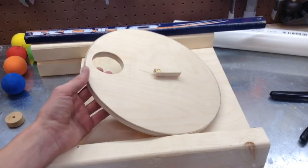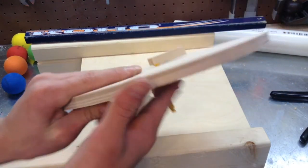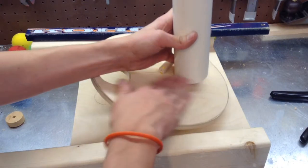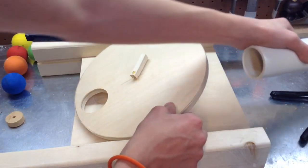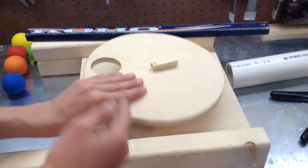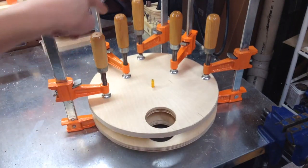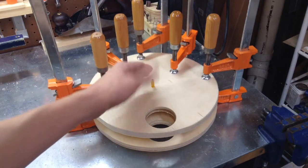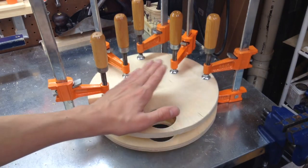As I've been working on this design, I figured I needed to add a little spacer here and make one more to go on the bottom. The pipe is going to sit here and needs to be flush with the top so the ball rolls through the tube without getting jammed between the tube and the plywood. I have it glued up now with multiple spacers around the outside and a center spacer clamped in place. The holes are all lined up, so I'm letting this dry.